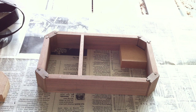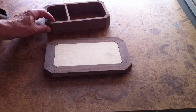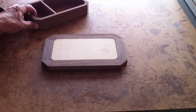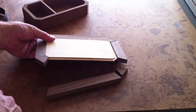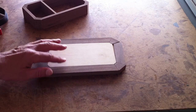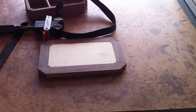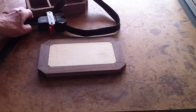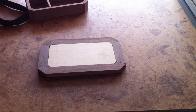We've got the base of our music box loosely fit together with this plywood bottom. It glues to the top and follows the shape of the music box. I had to cut a groove in each side piece and then cut a rabbet on the plywood so they all fit together and sit fairly flush — just needs a little sanding. I'll use a band clamp to put that all together, checking to make sure it's square. Then we've got some feet to glue on the bottom, and after that we can router a decorative profile on the edge to give it a little bit of pizzazz, because right now it's kind of plain.